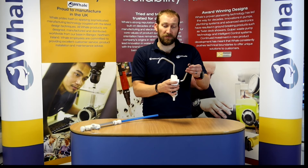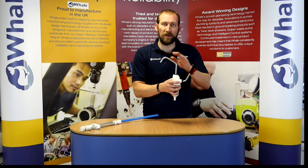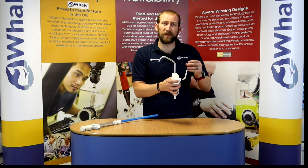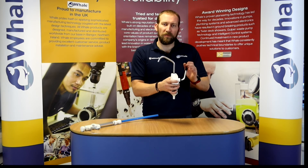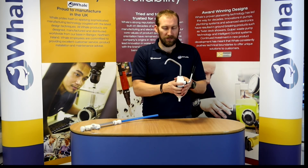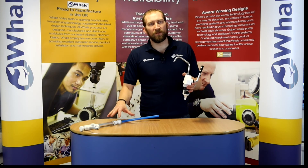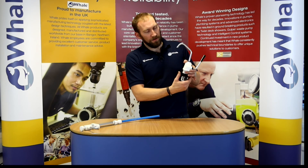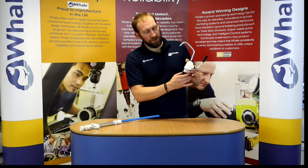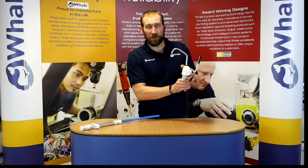In order to prime and supply water to it, just move the little handle back and forward and much like the V-Pump you'll start to feel a bit of restriction or resistance. You keep on pumping and then the water will flow very nicely. Both of these pumps are self-priming so they can lift the water from down in your fresh water tank, and as with the V-Pump you just need to drill one single hole in your countertop and mount them up below.